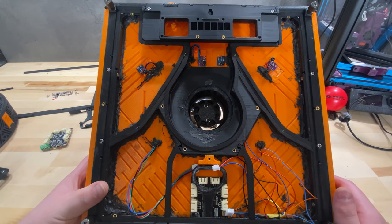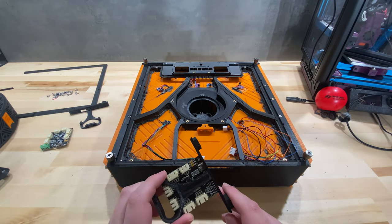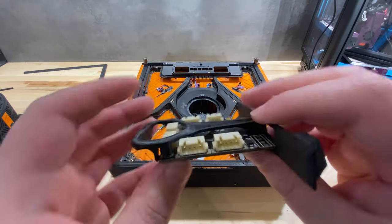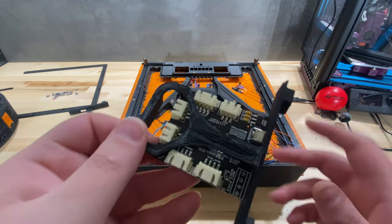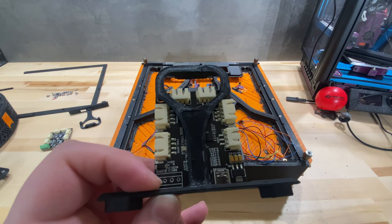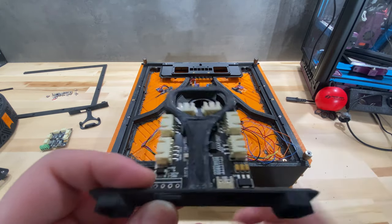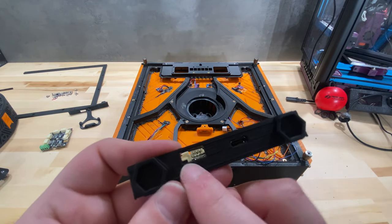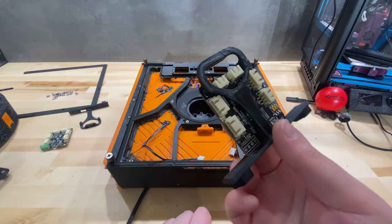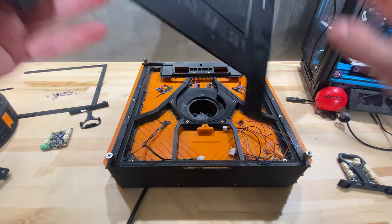This part is where you hang the electronics. You can normally have a Raspberry Pi Pico here, but in my case I have a custom PCB I designed, on a custom mount. The Z height is very limited in here. The point of this custom PCB is to make the wiring a lot easier and add more functionality. With the stock electronic setup there is no fan control; with this you get fan control, extra fan channels, and easier wiring — just plug in the sensors, the NeoPixel, and connect with a USB-C cable. Power is via a JST XH connector.